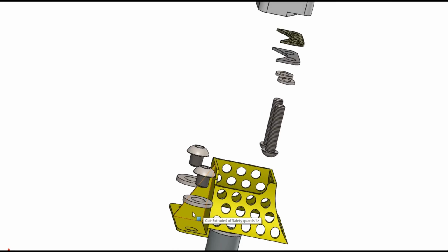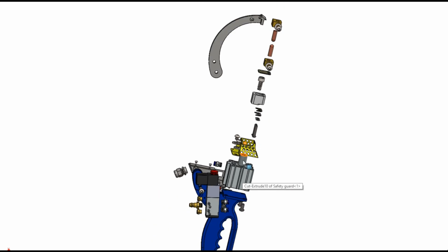This wee triangle piece of aluminium in here is TIG welded in, which is now powder coated. It acts as a right angle support because there's a bit of pressure against this. For instance, if the pneumatic piston has no air in it or no air connected to this coupling, I cannot move this nylon block in and out with my hand. But if this guard wasn't on, the nylon block comes in and out easily, so it's good.